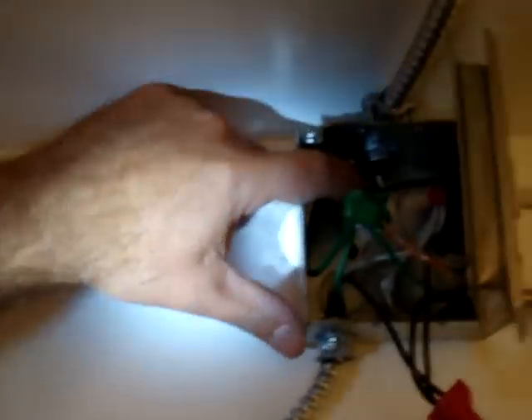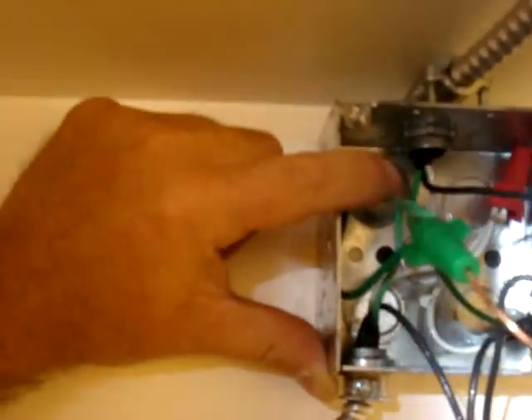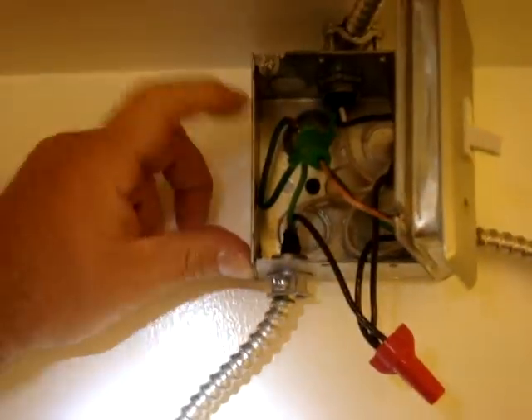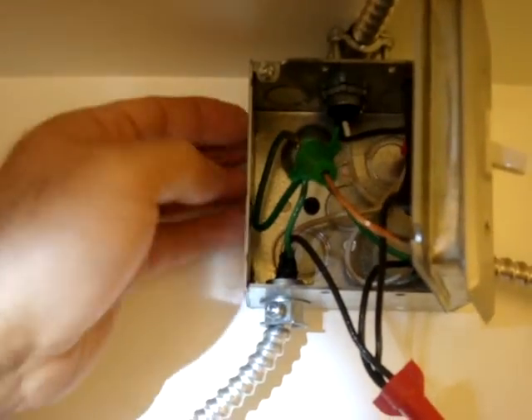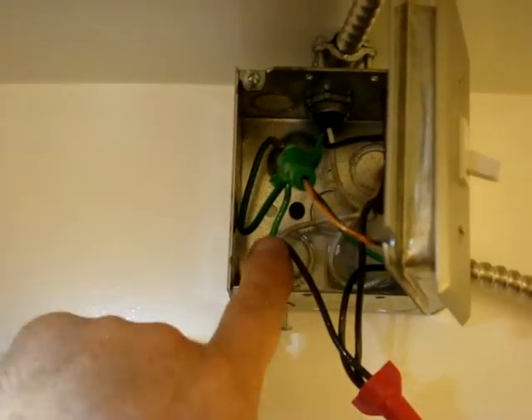This is the ground wire coming in from the top — the one coming from the top that goes back to the panel. And this is the ground wire that goes back and is secured to that screw in the box. So this box is grounded all the way back to the panel. These two ground wires here go down and ground the lights.